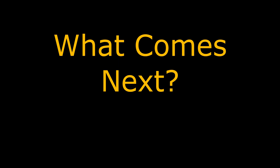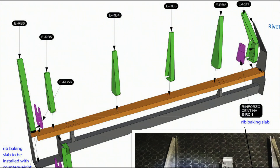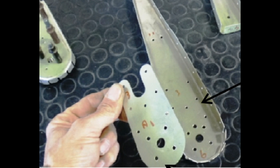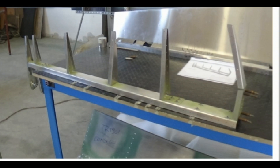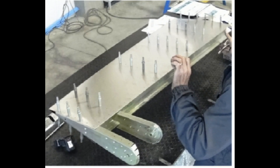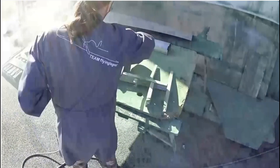So now that you guys are up to date, let me tell you what comes next. This weekend I'll be working on preparing the new elevator spars for priming and then countersinking their 20-plus holes to get them ready for flush rivets. Once I prime these parts, they'll be ready for pre-assembly and the final application of the nut and reinforcement plates. The semi-final step will be the riveting of the ribs to the spars. At that point, the elevators will be ready for final priming, and I'll just need to get the horizontal stabilizer assembly riveted as a final step before doing the final priming push.